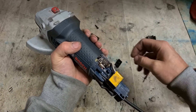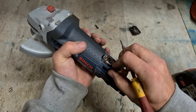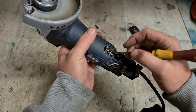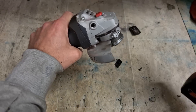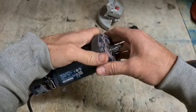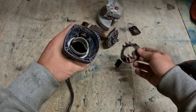Pull the motor out. You also want to disengage the brushes, because the dust shield ring on the end of the armature will snag on the brush. If you pull it too hard, you'll end up breaking the brushes. The head can then come off — pull out your motor and pull off the dust shield.